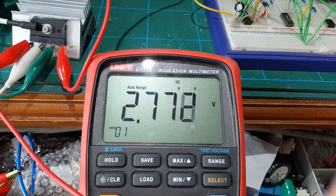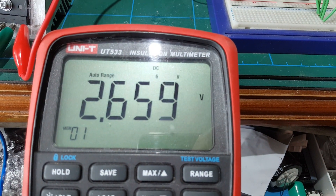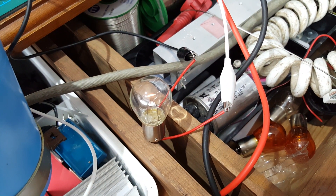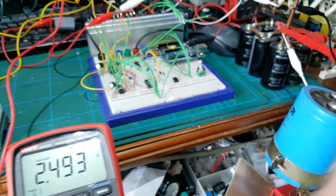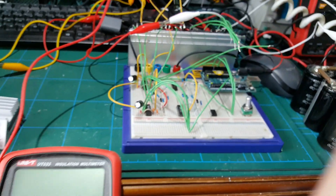That's still charging. Let's say we've finished regening now — we've got to the bottom of the hill, we'll take the brakes off. Power's still stored in the capacitors and it will now be getting boosted up to a high enough voltage to charge your batteries. So I think that explains the concept. I'm not going to go any further with this DC motor controller, because I've got no intentions of actually building one — mine's going to be AC, so a lot more attention is going to be paid to that. Thanks for watching. Next week I'm going to start building an AC one and I'll see you then. Cheers, guys, bye.